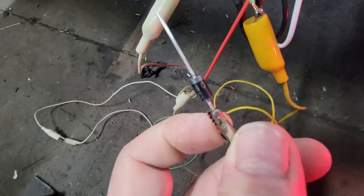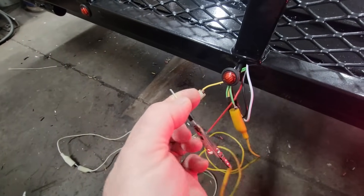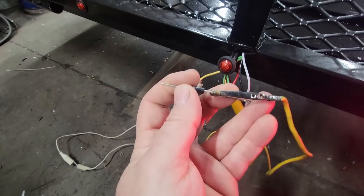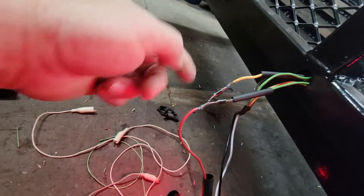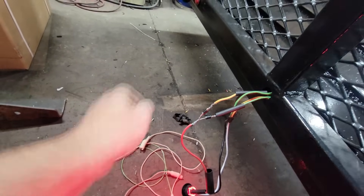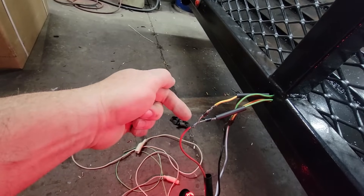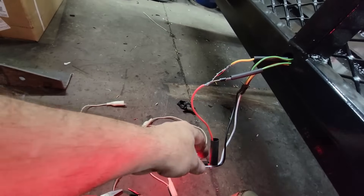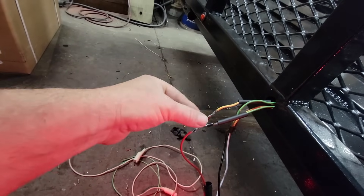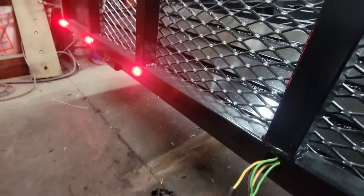The printing is so small - I used to be able to read these very easily when I was younger, now I struggle. I'll cut these down a little bit so they're not too long to shove inside that tube with all that wiring. I took duckbill pliers, held the ends of the two diodes together, and twisted the ends so I didn't deform or crack the insulation. Then I soldered them and applied deox - two layers of small heat shrink individually, then one large over all of it.